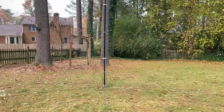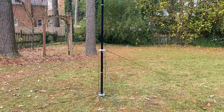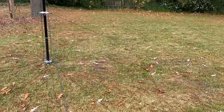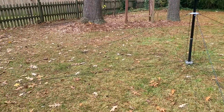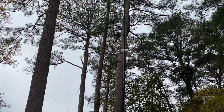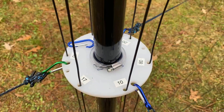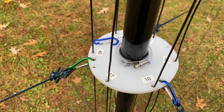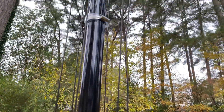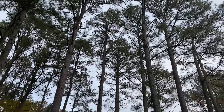If you're not familiar with Callum's antennas, this is the DX Commander. It's not the classic — it's the step-up with the 80-meter version, but basically the same antenna as the classic. You can see all my radials going all the way around the base of the antenna, and there's the feed line. It's a 30-foot telescopic fiberglass pole with elements for 10, 17, 40, 12, 20, and 80 meters. The 80-meter element actually goes up to the top of the pole and then off in an inverted-L over to that tree over there.